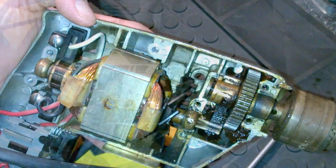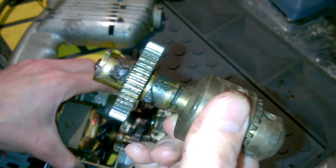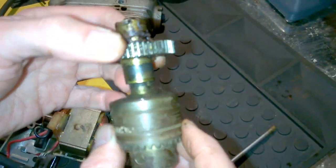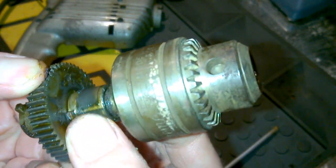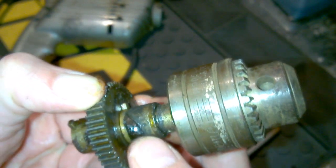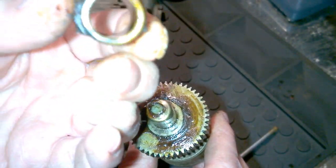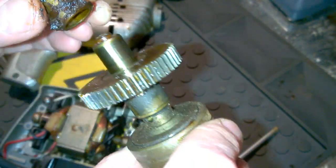Let's start taking this thing apart, grease it up, put it back together, then start with the painting. Let's get the chuck out — should slide right out. There we go, pretty easy. We've got that single gear connecting it to the rest of the assembly, a couple of sleeves, and the chuck spins smoothly. Nice solid metal gear — this felt pretty substantial, not some cheap pot metal like you might see in a more modern drill. No broken teeth, no wear I could tell. The chuck itself is Supremo brand. There's a bronze or brass sleeve on both ends — nice substantial metal, nothing plastic in here, which is always a surprise and a delight.